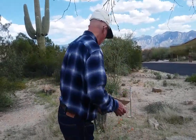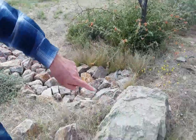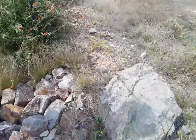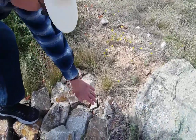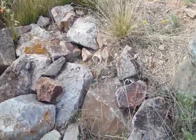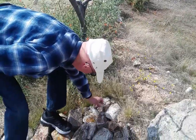Come around with me — here's our fourth overflow tube. You'll see that the overflow from this tube comes under the top of the berm and out here where we put rocks to prevent erosion. Our homeowners association doesn't like to see plastic pipes, so we've put some little rocks here just to camouflage them a bit. If we pull these out, you can see here, here, and here is where the water comes out when the catchment basin is full during our rainy season. We can put these back — they don't impede the water, but they make it look a little nicer.